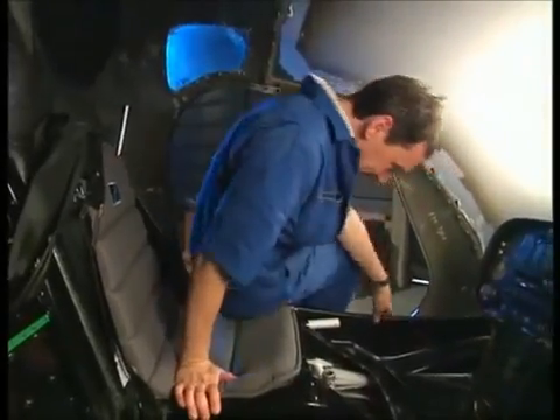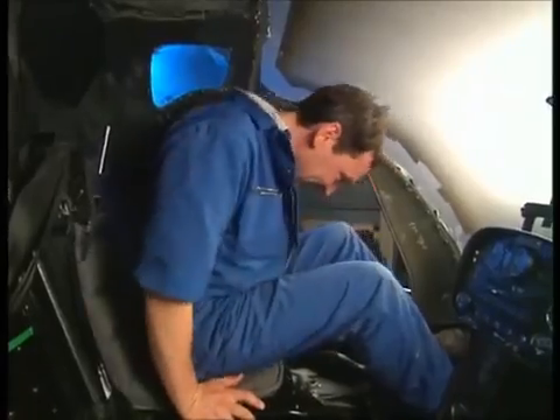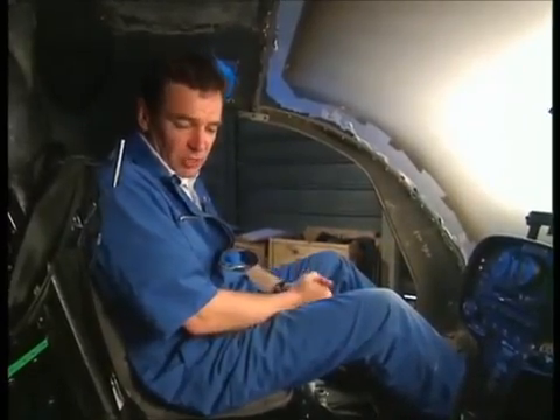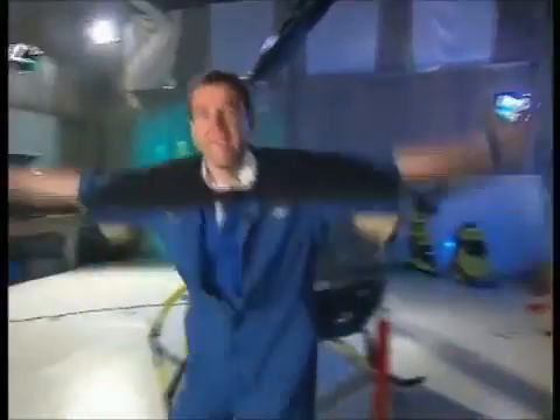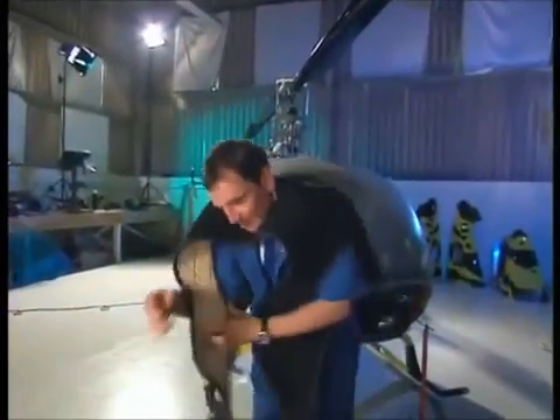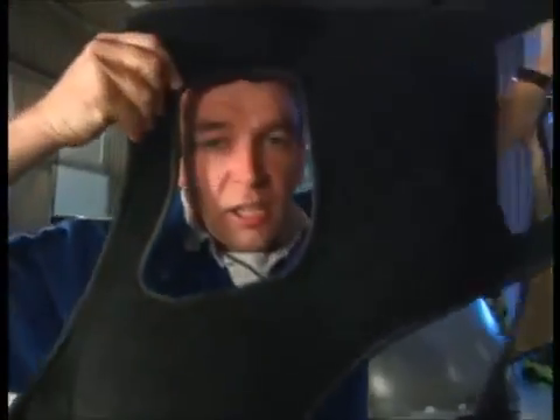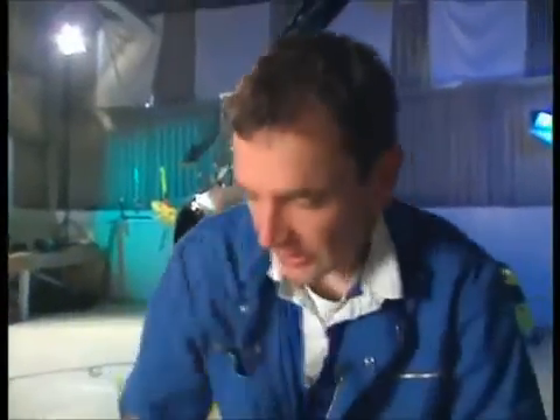The nut plates are in. I've got the aluminium strip already in here and my two screws through ready to attach it to the fibreglass. One in there and one down there. Now I need my foam. There will be a panel on the back but don't worry about that for now. And then the seat will sit like that. Suits you, sir. Very nice indeed. Now Pete, mate, if you want a ride in this helicopter, may I suggest you find yourself something to sit on. This will be the headlining. Groovy, huh? Where my head was there will be the switch panel up in the roof of the cockpit. These are for the little eyebrow windows. And to put it in, it's a gluing job. I've already put the glue in the cockpit — it's just going off because it needs to be tacky before we stick it.